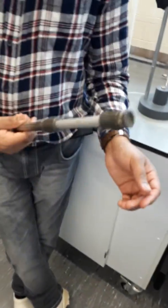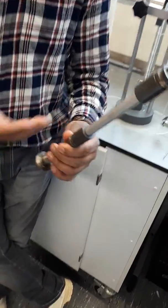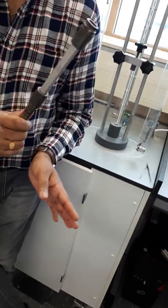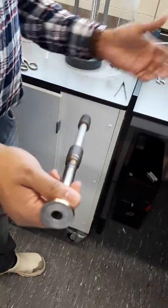Afterwards, we have to quality test the membrane again because it has seen such a high temperature, because welding goes to almost like 1600 degrees, and the membranes are designed only for 600. Understood. So it's such high temperature, so we have to check if the membrane is still good enough. For that, we have to check the same way as we have done before, but in a different sort of system. We made this system